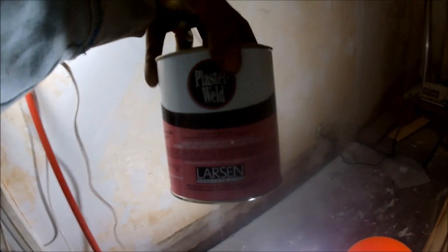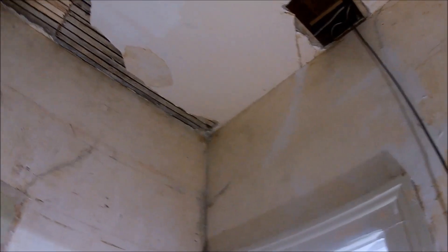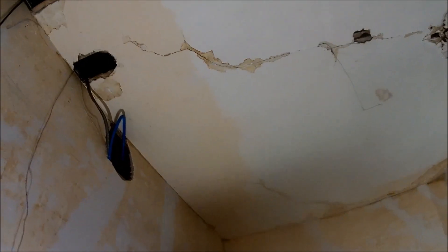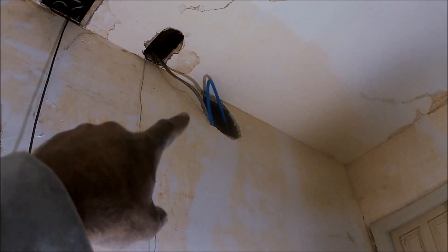That's how to clean it up and put your base plaster on. If there are any cracks or loose material, pull that off before you put your plaster on. I still need to vacuum it, and then I bought some Plaster Weld by Larsen — there's a guy on YouTube who recommends it. I've never tried it but I'm going to try it — it's a liquid lath that bonds wet plaster and cement to any structurally sound surface. Just paint it on and then apply your plaster right over that. I've got one little hole to fix and I'm still figuring out whether to run lights in the ceiling. If I don't use them I need to get rid of the switch, the light, and the electrical wire, and seal up the hole. There's also another cable that ran through one wall cavity and crossed into another, so I might have to break all this lath and plaster to tuck it in.